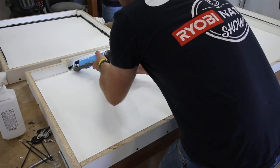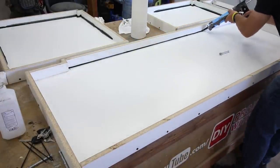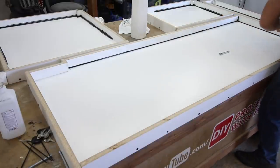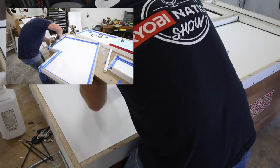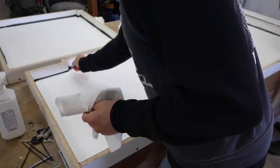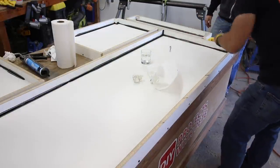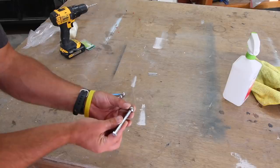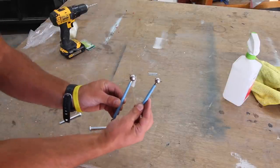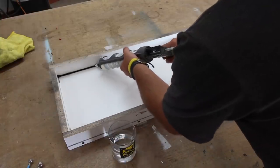You'll want to seal the edges of the mold using 100% silicone. Black is a good color because it's easy to see when cleaning up the excess. The silicone will create a nice rounded beveled edge for your concrete counter. In a lot of my other videos I've taped everything off and then applied silicone, but a couple folks suggested using a ball bearing or a cake fondant tool for this process — and that's what we're using today. It worked really great, much faster and gives a much better rounded edge than taping. You can make your own round-over tools by gluing a ball bearing to a bolt, or simply order cake fondant tools on Amazon — links are in the description and on DIYPete.com.